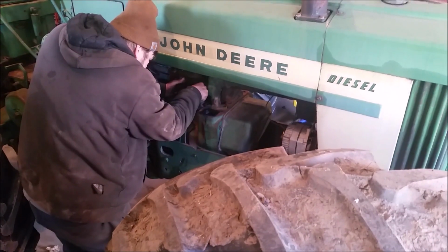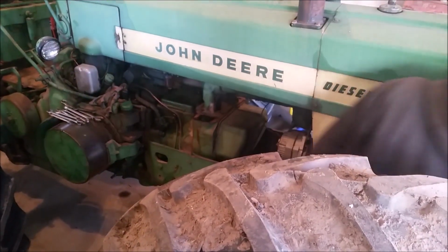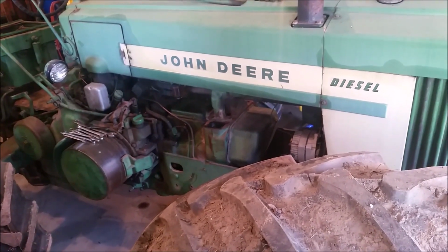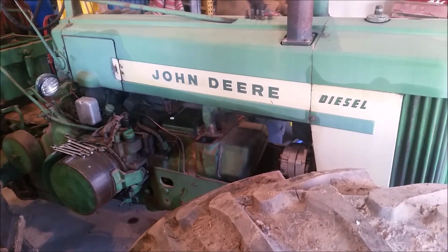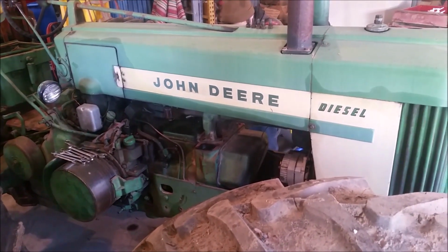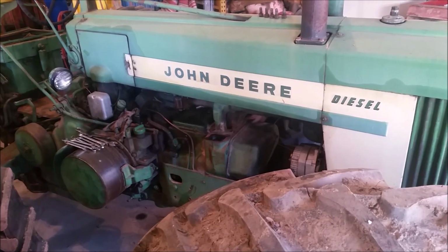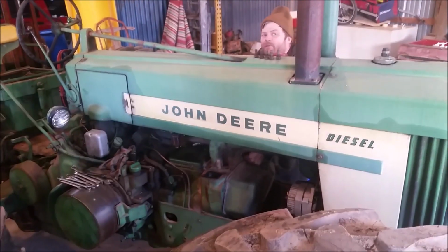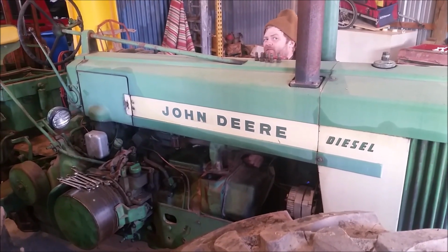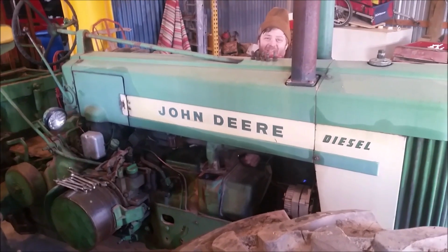So we'll know if it's the head gasket here just a little bit. And I hate to have to take the head in and have it checked again, but we already did. But if the head is bad, it would blow out the gasket in the same spot? For some reason on these, when they have something wrong with the head, they'll make the head gasket blow. And there's these little spots in the head, like behind the valve, where some guys, when they check them, don't even catch it.